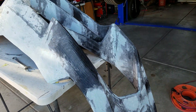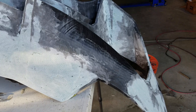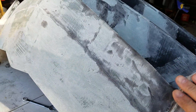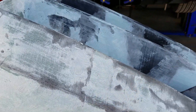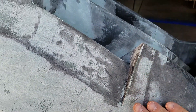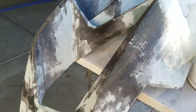You can do it all by hand if you want to take a while. So we smooth it all out — it doesn't need to be really finished like you were going to paint it. What you don't want is lines to show through. So these bond lines, you can see them here but you can't feel them, and that's kind of what you want before you go to the skinning process.